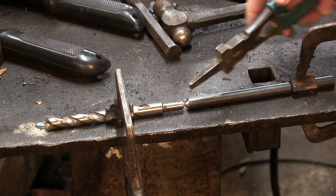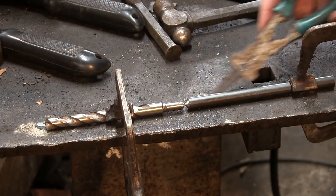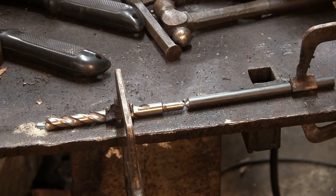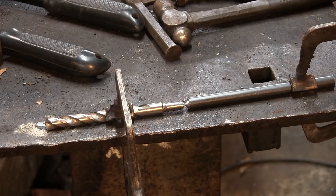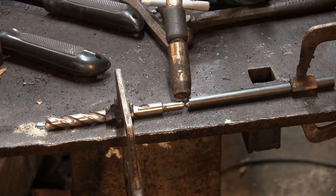You can see I've got everything chucked up, and notice I have not cut this piece yet - that's so I could lock it down and have an easier time making sure everything's straight, lined up, and clamped into place. Notice my bevels right here so I can make sure and get a full weld all the way around. All I need to do now is MIG weld this. Jay in his time would have oxy-acetylene welded, but I find that oxy-acetylene welding can lead to a much enlarged grain structure if you're not careful, so I usually prefer to use the MIG for stuff like this. I'll tack a little bit at first and then come back in and fill it in.